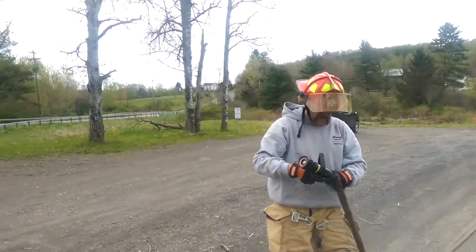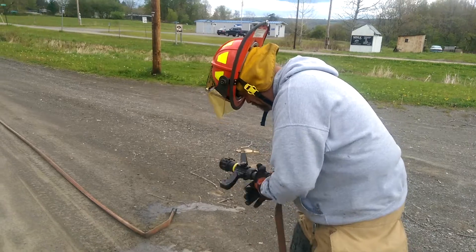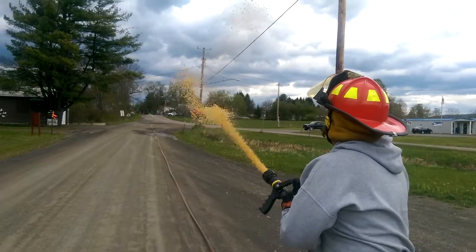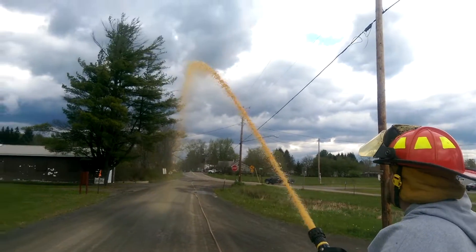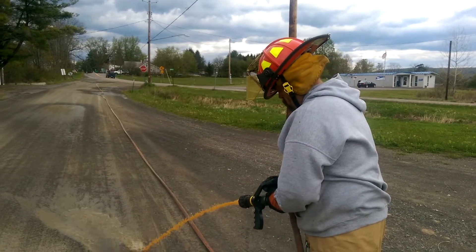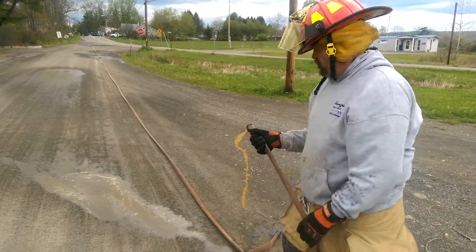No change in RPMs or anything. It's just a little skid unit slid in the back there, 300 GPM little skid unit. No change on the nozzle whatsoever, as you can see. You can see our reach — we're starting to do a lot better. That's just friction loss changing that. Just GPMs. It's almost like nozzle versus smoothbore.